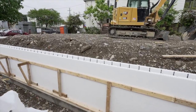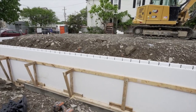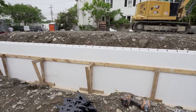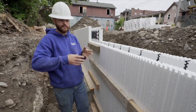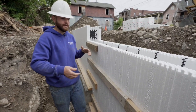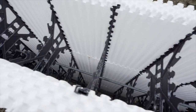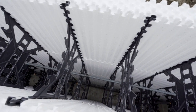Any of the suppliers that sell these give you instructional courses — you can get certified in them. They're actually pretty simple. You start in your corners and work towards the middle, put your cut piece in the middle. Then once you get one row done you attach your rebar as needed, and then you go back, set your next course, and work towards the middle again putting your piece in the middle.